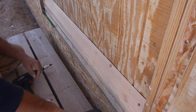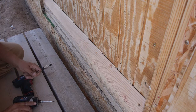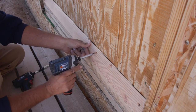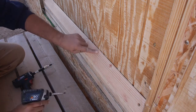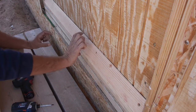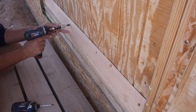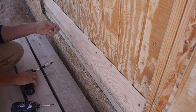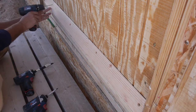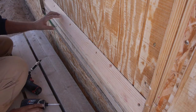The issue was I used styrofoam to make the core of the door, which wouldn't grab the screw. But yeah, that helped a little bit. But I built the door with a full 2x4 on the edge, so that gives me enough wood inside. So it should work. Good. We're getting somewhere. So I'll just do one more here. Yeah, now we're talking. Good, okay.